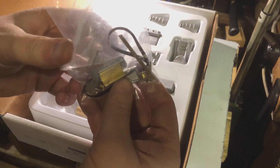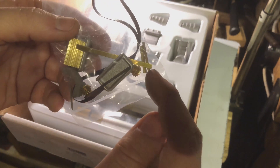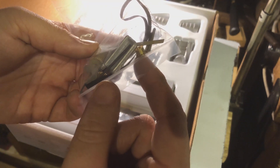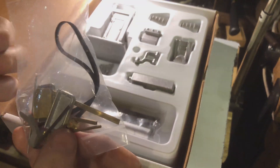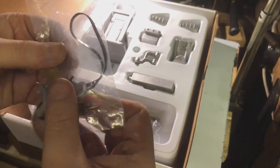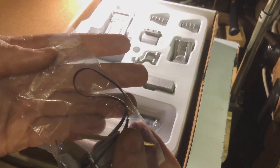Here we have some of the other extra little bits. These are little tool trays where you stand your little wrench and that kind of stuff. These bits of brass I do believe are for the Gibbs, and there are also counterweights for things. The nice thing is that the bevel gears that translate the cross-feed come pre-machined, tapped for set screws — that is super helpful. Trying to cut bevel gears yourself at home is doable but it's a lot of work. You also get the belt drive that would drive the actual machine and the cross-feed.